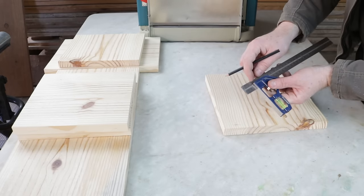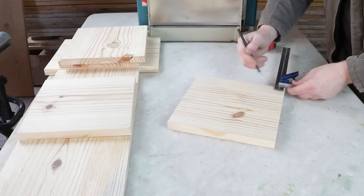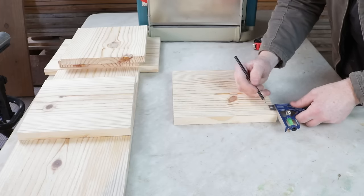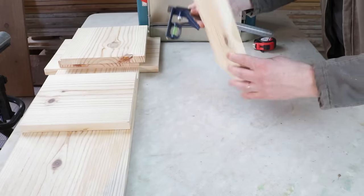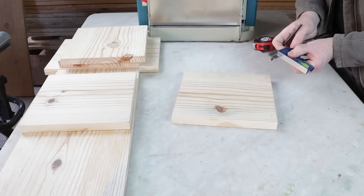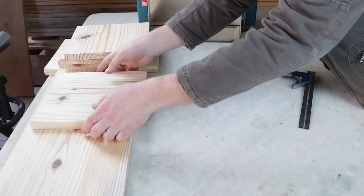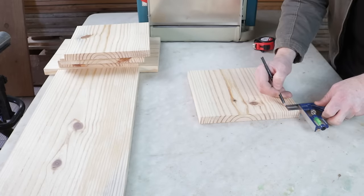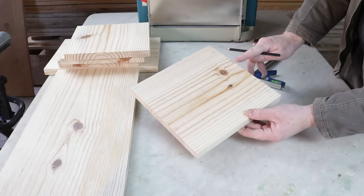I've gone back to the 3 centimeter mark and I'll make the marking on this piece that measures 25 centimeters or 250 millimeters. The marking will be made on this side and this one. I'll also mark with 11 millimeters in the opposite direction. Now I'll turn it over and repeat the same marking on these two points. I'll now mark this other part that measures 25 centimeters as well, with the marking made on only one side.